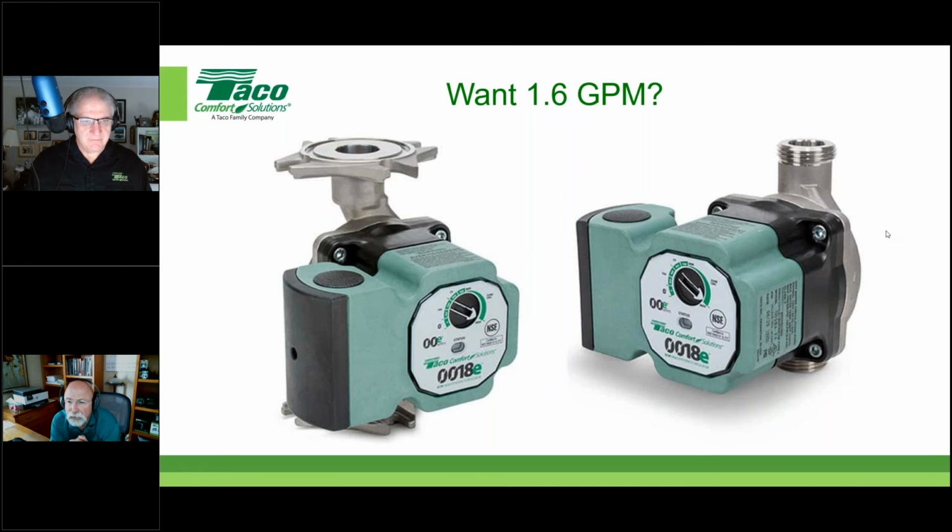All right. Kurt, any concern about flow reduction from pressure drop on the hot water supply line at the tank when hot water system for a large house such as two showers running at the same time? Any concern about flow reduction from the pressure drop in the hot water supply line? Kirk, are you talking about having the pump on the supply side going out? Yes. Okay. So again, we don't have CVs listed for these pumps because they don't impart friction in the normal application. They apply mechanical energy or pressure differential. Yes, the answer is yes, but we just can't tell you what it is.